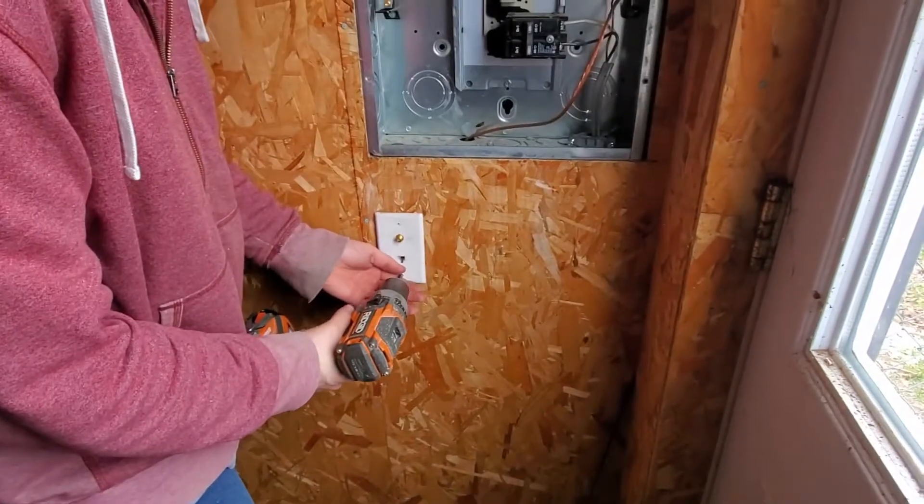Here I'm bringing out the line to pull and I'm using Cat5e. I know a lot of people get hung up over having Cat6 or Cat7 these days, but if your runs are under 150 feet you're basically just wasting your money. Cat5e is more than capable of doing 10 gigabit per second up to 150 feet, and that's basically future proof for my lifetime. It's highly unlikely I will ever see anything in excess of 10 gigabit per second.